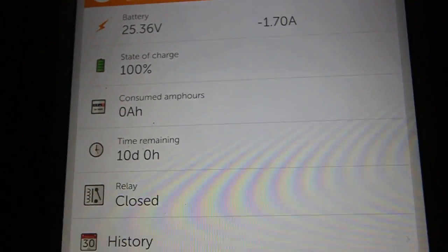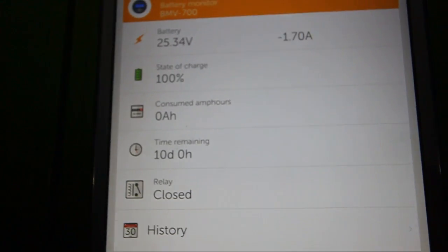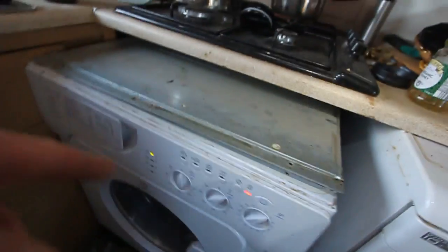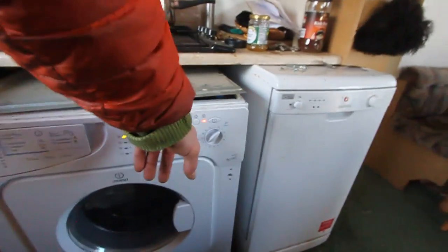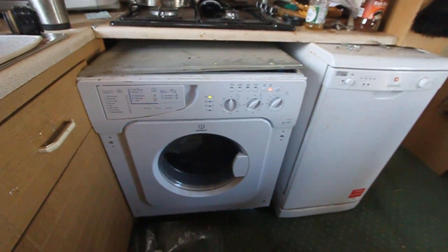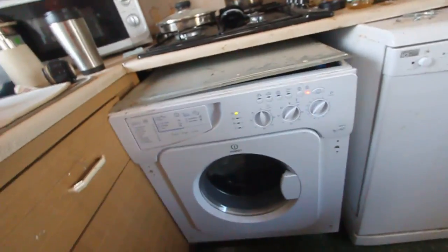We're gonna try now the washing machine, which I just fixed because the door lock was broken, but probably 1.6 kilowatt Victron will not be able to handle. But we'll see what will happen when we start heating water. I have 30 degrees right now, but if the immersion heater is 2 kilowatt, then we'll hear overload. But let's wait for now.